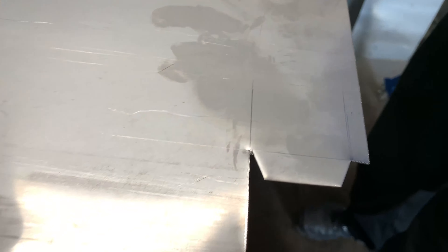Okay, now that's done. And if somebody is interested in stainless steel, you can always put a message in the description down there and we will see what we can do to make that happen. Now we go to the bigger bending machine. I'm going to put this in because it's oversized. I'm going to do the fold first and then we're going to bend it to complete 180 degrees and then we're going to squeeze it.